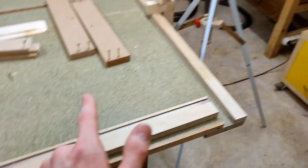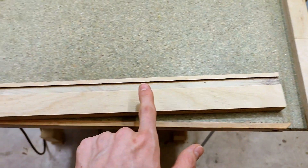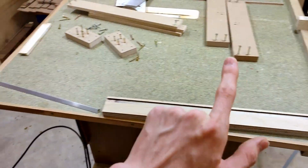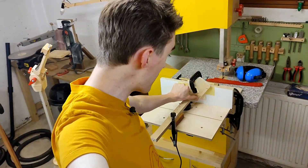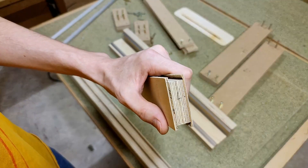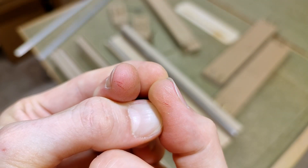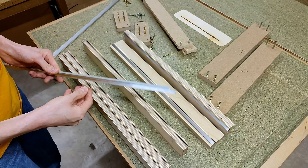This is also a perfect example of why the router table needs to be as good as possible. You can see we went through the layering of the plywood towards both ends but not so much in the middle, which means the slot in its entirety is bent slightly — and that's of course going to transfer to the linear rail. A real bummer, and keep in mind this happened even though technically the surface of my router table was bulging, because the pressure of the featherboard pushed it back. I ended up doing all the vertical ones off-camera since it's basically the exact same process, just a little bit more fiddly. In doing that I also sliced up my thumb and pointer finger — turns out these edges are actually insanely sharp.